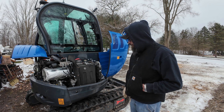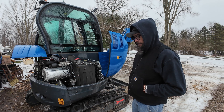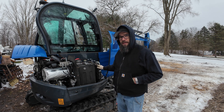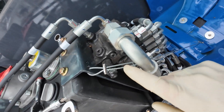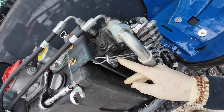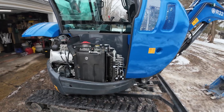At that point in time I did not have a pressure test kit. Today I do have a pressure test kit that I ordered off of Amazon — I will put that link in the description of this video. From my understanding, this is your breakout pressure relief and that is what we will be adjusting today. I'll bring in and show you a little closer so you can see it — it is this little Allen key fitting.